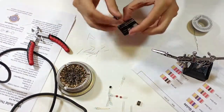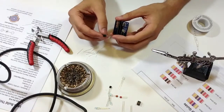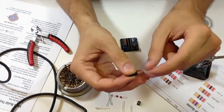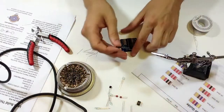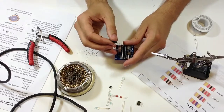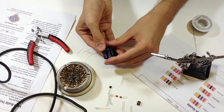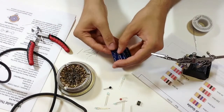The next thing not explicitly in the instructions but that advanced builders should know: the longer lead on a capacitor is the anode. You'll notice there's a white side on the capacitor — that's the ground side — and the rest is black. The way I remember it: the longer lead always wants the power more so it reaches for it. On my board I've got a minus side to indicate where the shorter ground pin goes, and a square pad to indicate the anode.